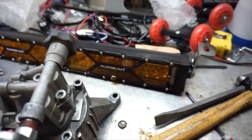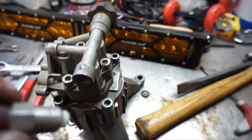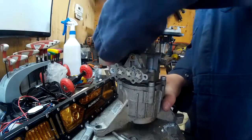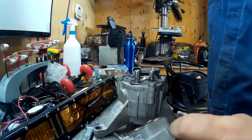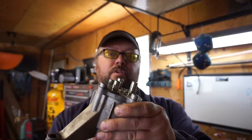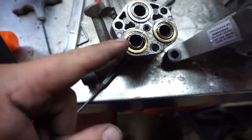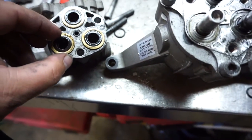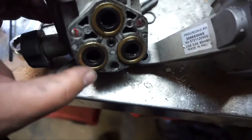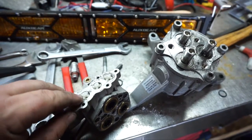Let's remove this top piece and see what we discover underneath. You can see right there the plungers are going down and up. There are three valves inside there. Basically how these valves work: fresh water comes in here, as the plunger stroke goes down it's gonna suck in water, and then as it compresses, that's gonna seal — otherwise it would push water back out through the suction — and then it's going to push this one open and allow the water to go out. These plungers go up and down as the pump flows the water out through these valves.